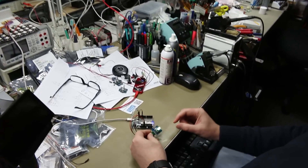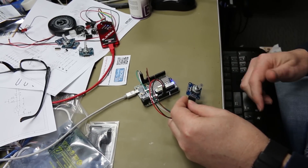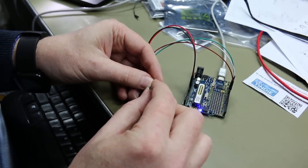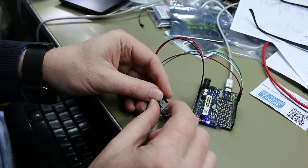So you don't have to do any I2C communications — you can just set a register to fade in or out. Basically, you adjust how quickly it does it. So when you twiddle it, it fades. You turn it one direction, it goes green, and the other direction it goes red.